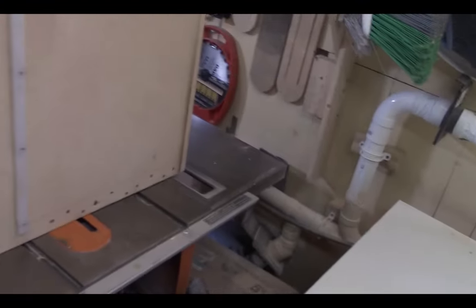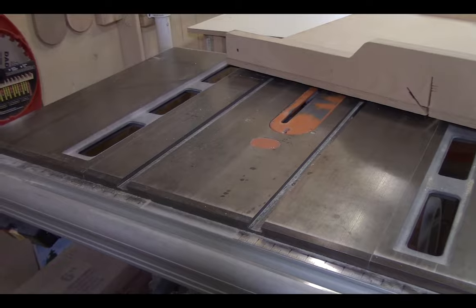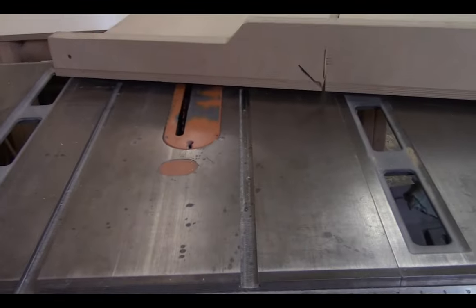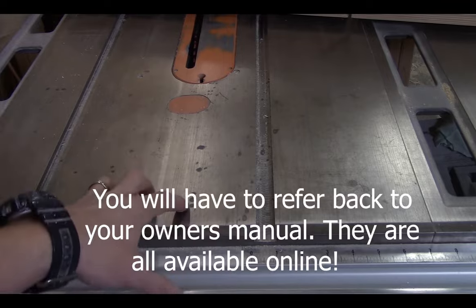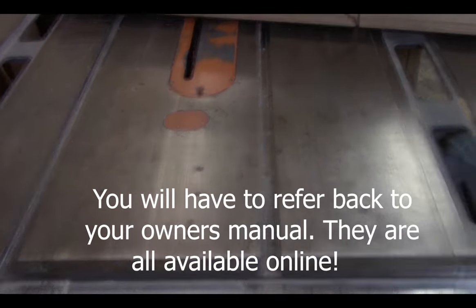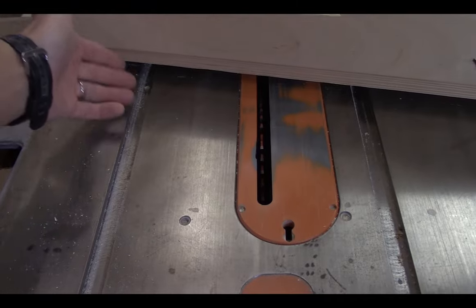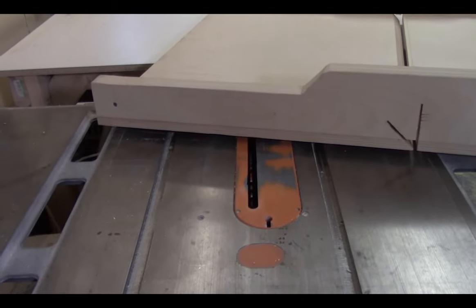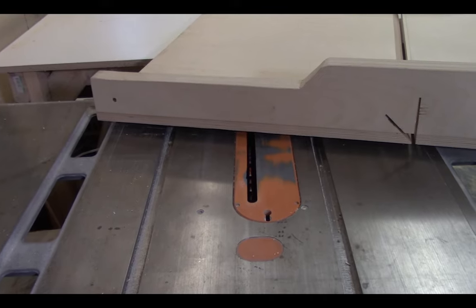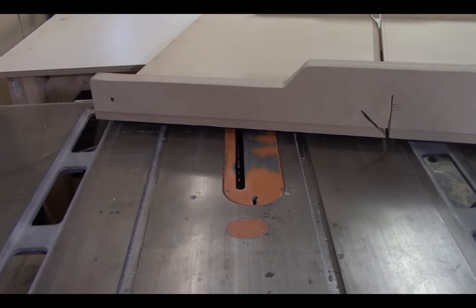It's all screwed from the bottom. When I put this thing together, the first thing I did was square up my table saw — that's very important. Some table saws have a cast iron top; some you square the table to the motor and some it's the motor to the table. I measured from my track to the blade, then rotated the blade to the back and measured from the back of the blade. They can come out of square over time just from use, so I squared it up and got it back into place.